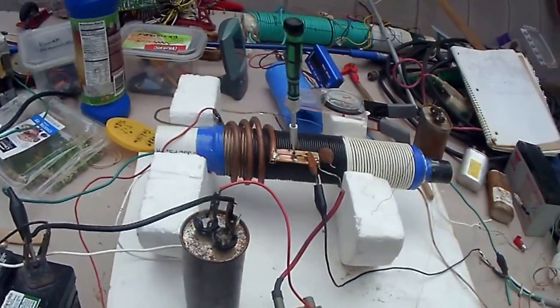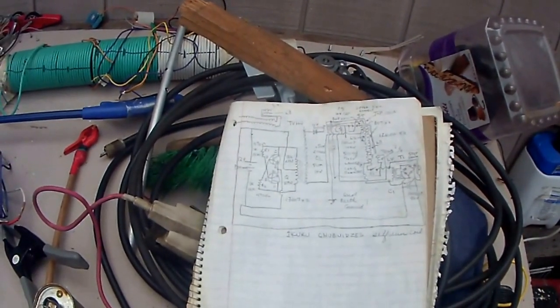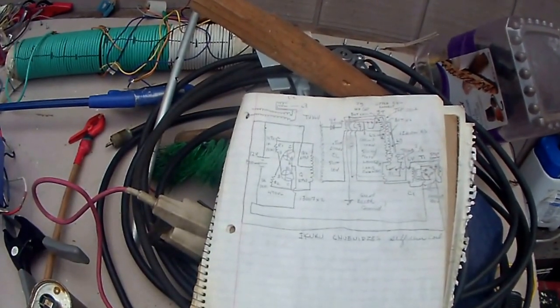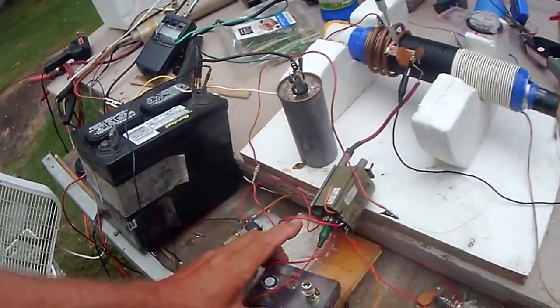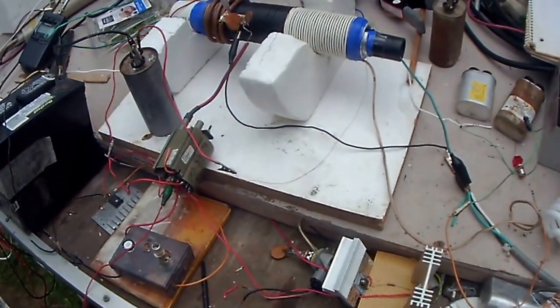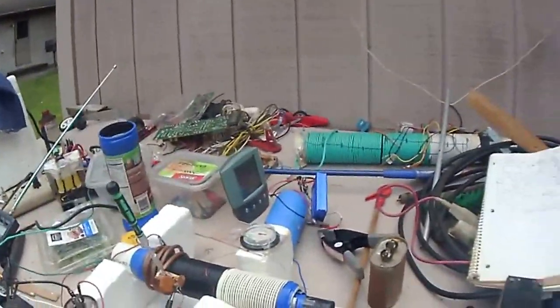That's all I have for today. I have no great power coming out. I don't see anything unless I've got something hooked up wrong. I've been trying a whole bunch of different combinations with the schematic. I don't think I have the right capacitor for the 1 kilovolt, 5 microfarad capacitor, but anywhere between 2 and 16 kilovolts it could be 0.5. I tried microwave ones. No matter what I tried, even adjusting the frequencies, even with this first ZVS circuit, I still could not get much power out of it. I have to do some more research on that.